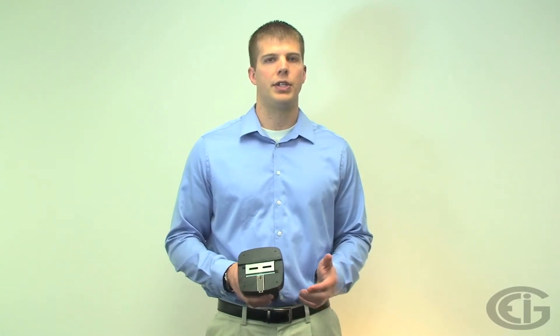The next form factor is the traditional transducer replacement, covered by the Shark 100T and 200T, where T stands for transducer. These models are used to replace traditional transducers that do not display data, but send data to a master device that collects power information. The Shark T models can transmit data using serial, ethernet, or analog retransmit signals.